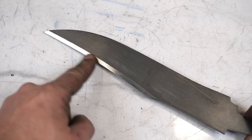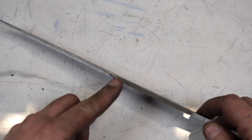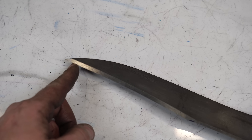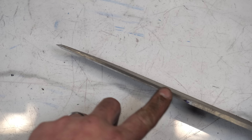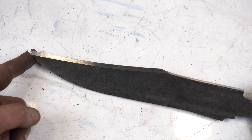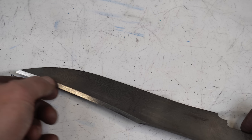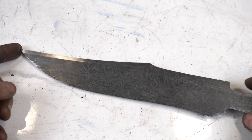Okay, let's take a look at our false edge — it looks really good, it's nice and even. Things to look out for: make sure these two little edges match, and make sure you meet at the edge with no spots where it's a little wider. You can see it's really easy with the right tooling. Trying to do this freehand is just hard — I don't advise it. Use a jig, use a rest, and get it done.